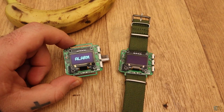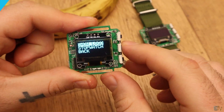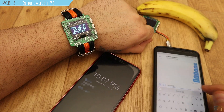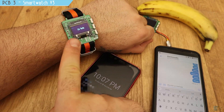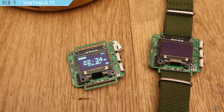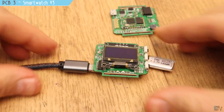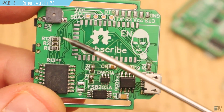Now we have the top 3. For number 3 I have one of my favorite projects — the smartwatch. This was a long project with all kinds of errors, but I was finally able to receive notifications from a smartphone via Bluetooth, set an alarm with a buzzer, get real time from a real-time clock chip, and display everything on an OLED display. The PCB has a USB connector with an FTDI chip for easy programming, a buzzer, LEDs, and push buttons on the side.